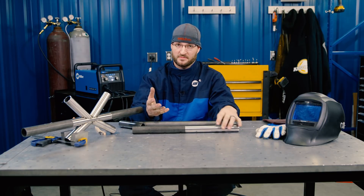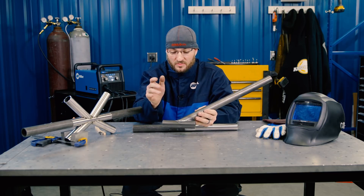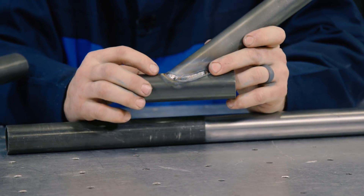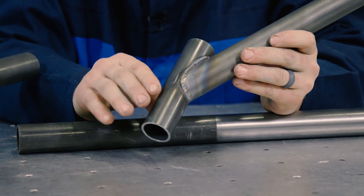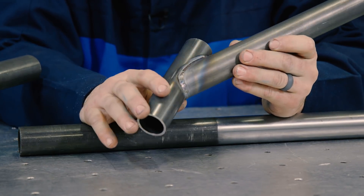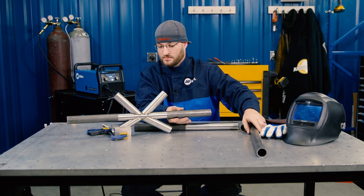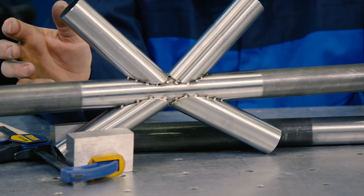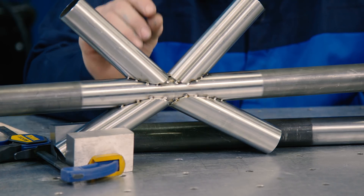A tube that hasn't been prepped like that is going to throw off a little bit more soot. You're going to go through tungsten a little bit quicker because you're going to get a little more of a boil to your weld. You can see right around the edges here — that's not from touching the tungsten, that's just from welding. So you're going to get a little less of a still pond and a little bit more of a boil. As soon as you prep both sides and get you tacked, you have no soot, no smoke, no funny business, and your weld out turns out a lot cleaner, smoother, and with a lot less crystallization.